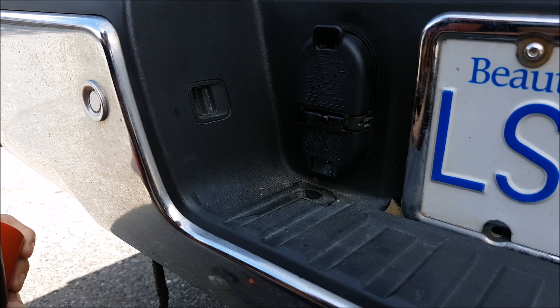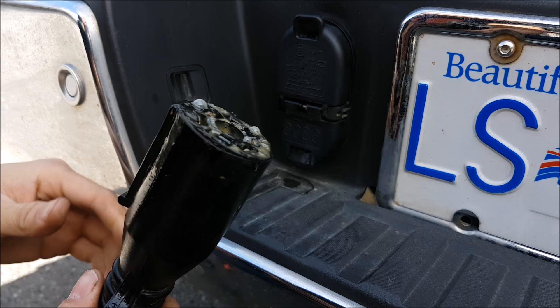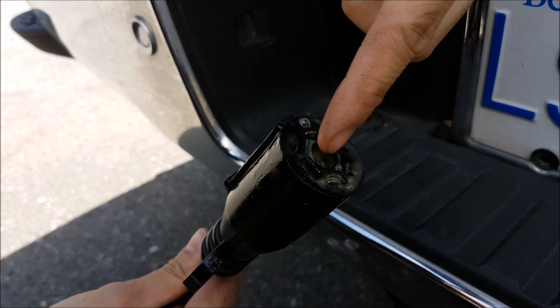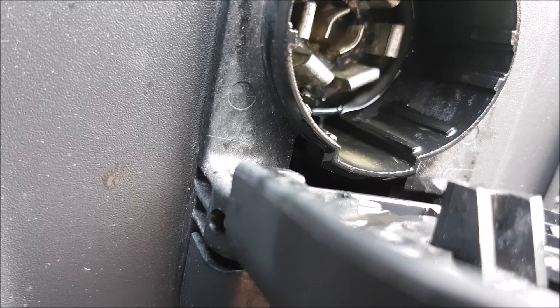After we're done using the contact cleaner, I'm going to use fluid film. The reason I'm using fluid film as opposed to dielectric grease is because it has similar rust-inhibiting properties and it works really well in these situations. Also, if you don't have caps and you leave connectors on a dusty job site, dielectric grease turns into a paste. With fluid film, it's much easier to clean out any dirt trapped over time. You will have to apply it more often, but because it's easier to clean, it's worth the trade-off.